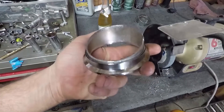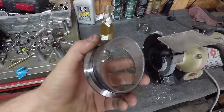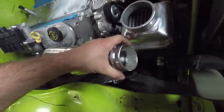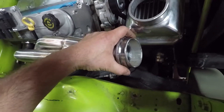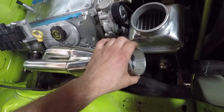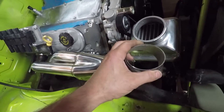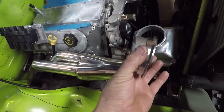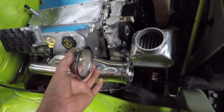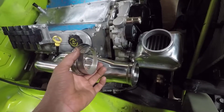Here is the beginning of my turbo downpipe. You can see where my turbo downpipe is going to be. What I'm going to do is pie-cut some 3-inch mild steel — it's going to come off a real super tight radius and then come back about 5 inches, where it will have another one of these 3-inch V-bands right here for the turbos to hook onto.